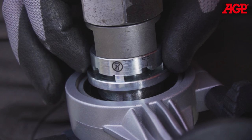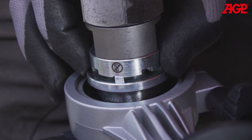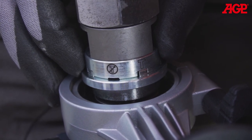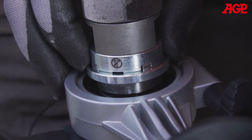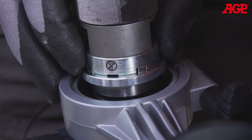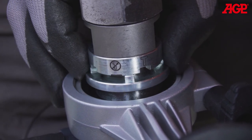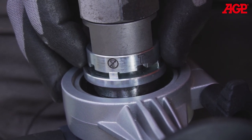The DM52 is equipped with a soft percussion function, which will help to keep the diamond sharp and assist in dust removal. This is a different purpose from the hard percussion of a hammer drill, which is meant to hammer the head of a masonry twist drill into the workpiece. If the bit stays sharp with the soft percussion switched off, it may not be necessary to use it. If the bit glazes easily, then keep the soft percussion switched on.